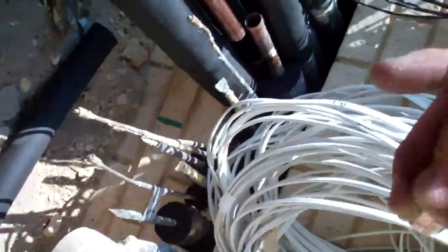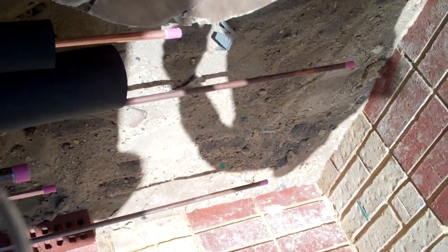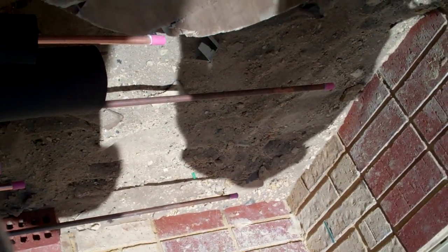So you pre-assemble these and then do the final installation where it connects? Yeah, I basically try and — because it's such a big pipe it's a bit hard to weld. It's not hard to weld but it just takes a bit to do the actual weld, so I sort of try and weld all those up. To avoid burning that, I've only got to weld down there, so I'll do that weld, then feed all the insulation on, then pull it back and try to clamp it up. Then I'll just try and burn it as little as possible. Sometimes you can't really avoid it but when they come out like this anyway.